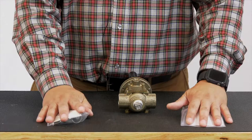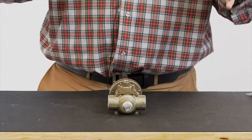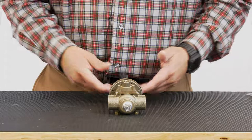All right, first and foremost, for shutdown procedures on rebuilds of these pilots, please visit our website for other videos. You want to make sure that you're isolated either through the pilot system with the shutoff cocks, your CK2s on the pilot system, or shut down with gate valves within your system as well. Once you've confirmed isolation, now we're going to disassemble the CRL.